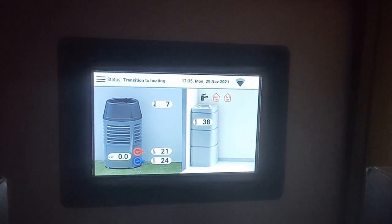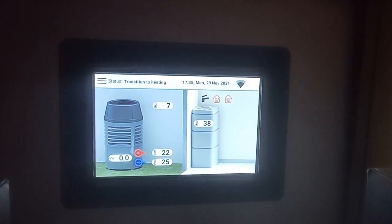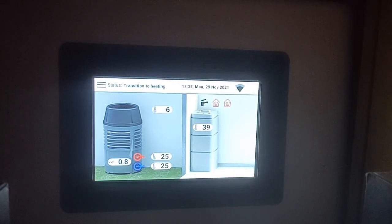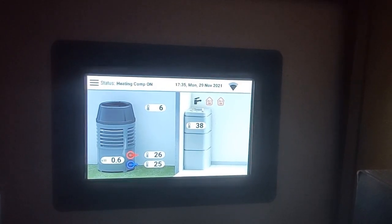After 5 minutes, this has transitioned to heating, so defrost is finished. You can see how the temperature of the water is no longer dropping because it's not cooling anymore — it's now going to start heating, and you'll see that temperature start rising as the compressor gets going. That is one defrost cycle on a heat pump.